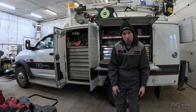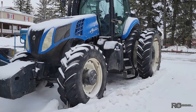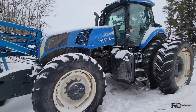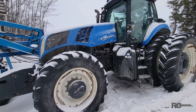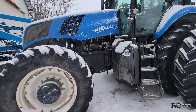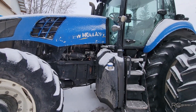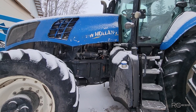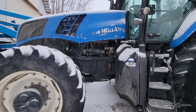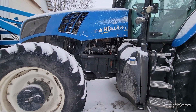Ready? Okay, I'll grab my jacket, let's get started. We got old Blue here that's got to go in the shop next. These tractors had an issue with the engine where they used bad o-rings on the packings for the liners, so they would drop coolant into the oil pan. There was a warranty for that but this guy's run just over the hours or it's a little too old, so they won't warranty it. We are getting that job - we're gonna tear it down, pull the liners out, put new packings on and see if we can fix this up.